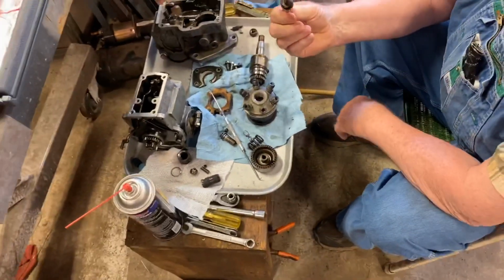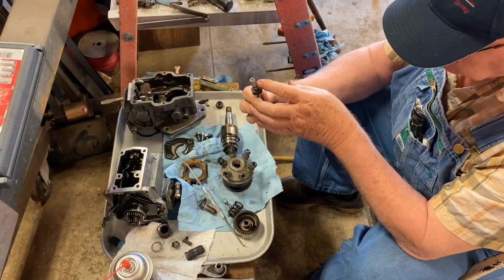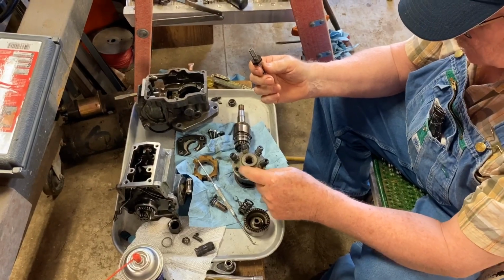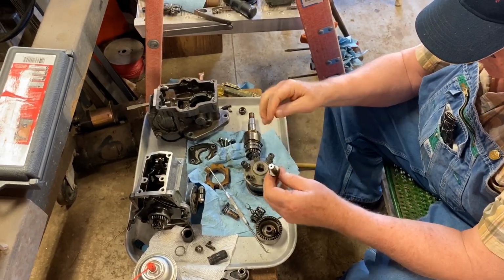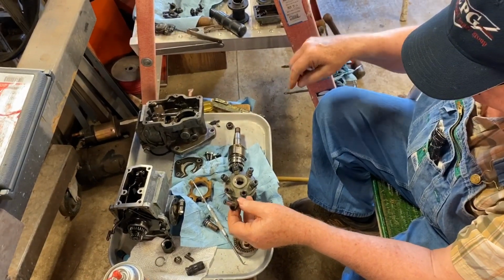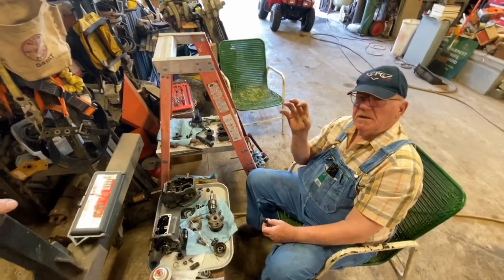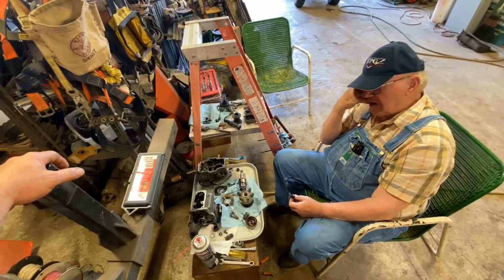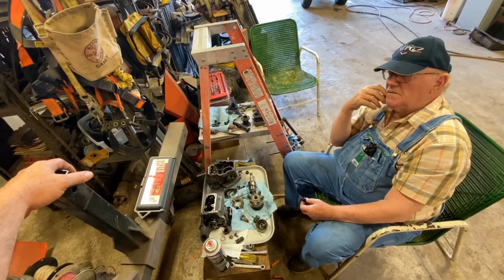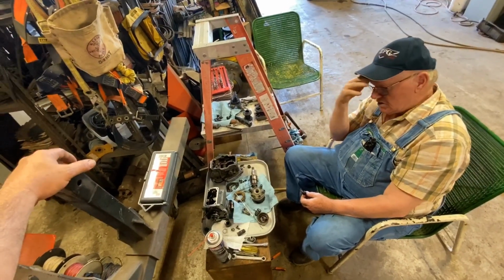Now, like I say, it's turning and it's lifting. When this distributor notch right here gets lined up with whichever injector on whatever cylinder, it will inject the fuel out these outlets to the injector. That pressure has to open the spring pressure on the injector for it to spray. I think it's around 2,500, somewhere in that range. I'm not real certain on that figure, but it's somewhere in that range to what it takes to make the injector open.